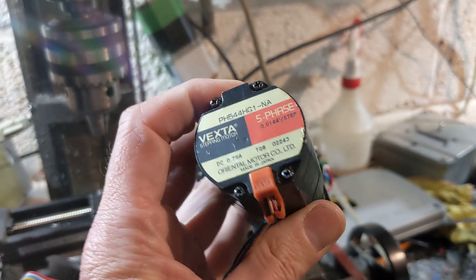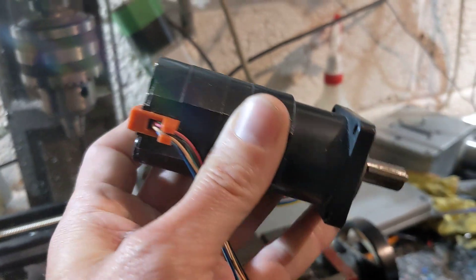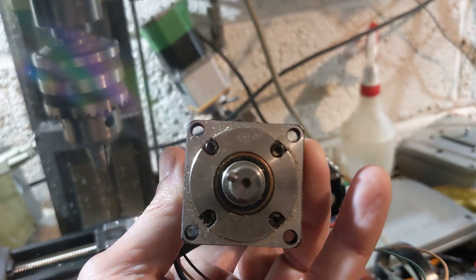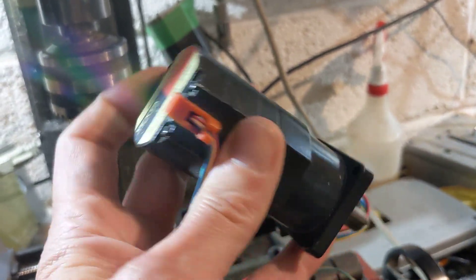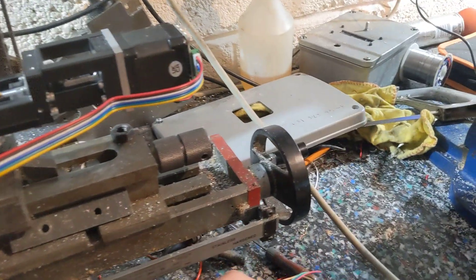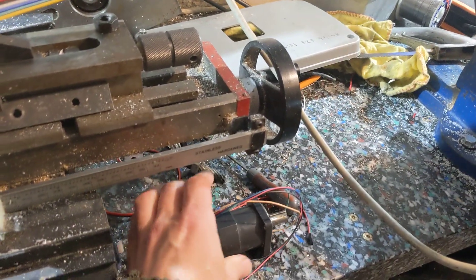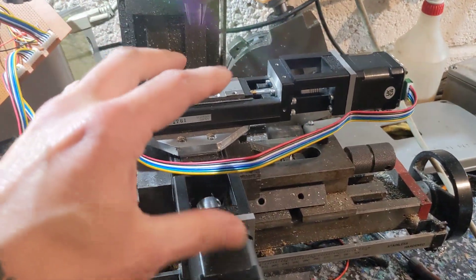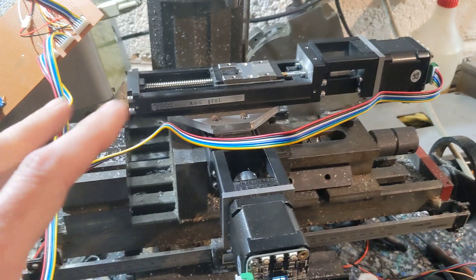This is a harmonic drive motor which is 0.01 degrees per step, and you can half-step it as well, so you can position things very precisely. It's also zero backlash — zero backlash. So it's a smaller scale but super, super accurate thing that's going to be a complete self-contained unit.